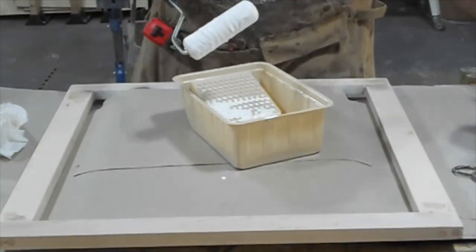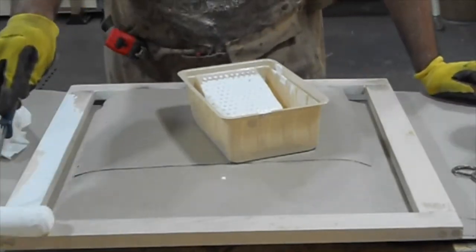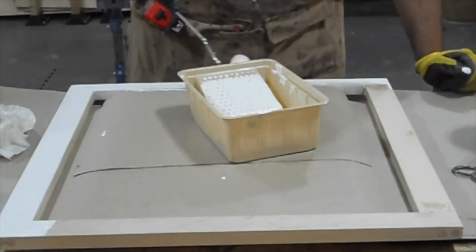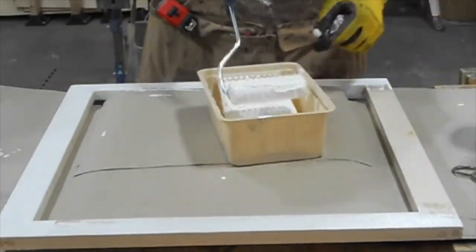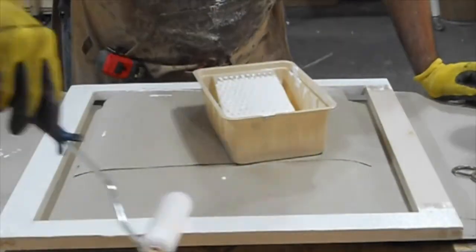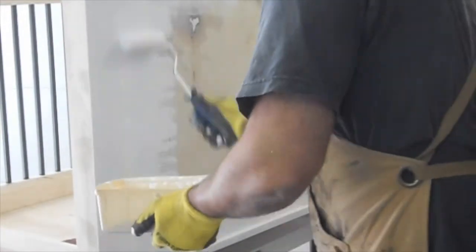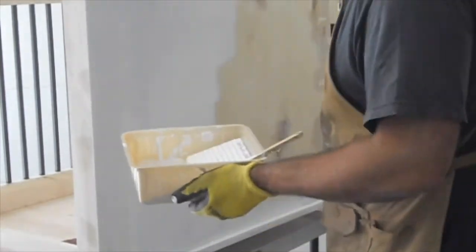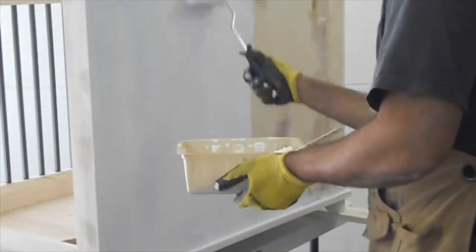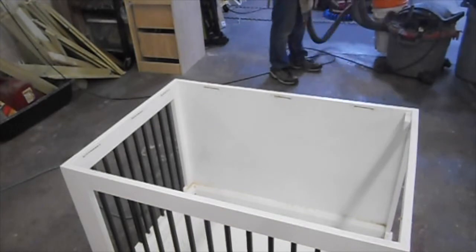To finish it, I'm starting with a good primer using Kilz Max, giving it a nice even coat with a roller. I wasn't entirely happy with the roller, but I didn't feel comfortable spraying with the bars attached. Using a roller means you'll have to go back and lightly sand it — extra work for a smooth finish. I did two coats of primer and then two coats of ultra bright white.